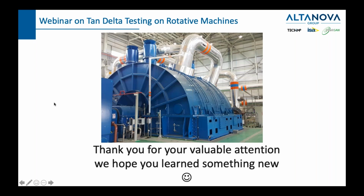Mr. Ali Baran asks: tan delta values are rising, and we want to understand whether the value is a local point or the entire winding. What should be the steps in this regard? You should try probably to do a PD test, because the PD test will tell you if you have any PD, what type of PD you have. That's what I would do.